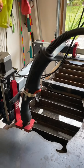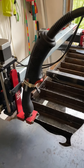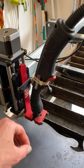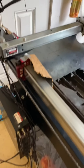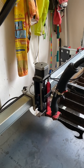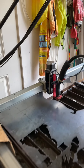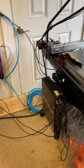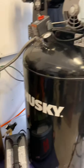I'm using the hand torch instead of a machine torch. The only big difference is with the hand torch you have to do some modifications — you take it apart and there's one pin you take out and put into another port to make it work with the CNC machine; if you don't do that it won't work. Then you have to zip tie things down. There's a good explanation on the Langmuir forum showing how to get it done — it's pretty straightforward. I think I've also made a YouTube video on my channel showing how to do it. Other than that, that's my system.